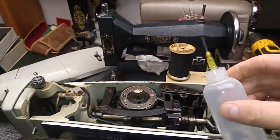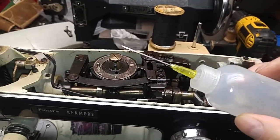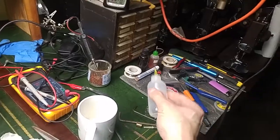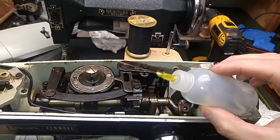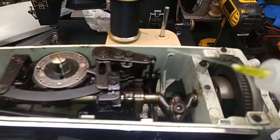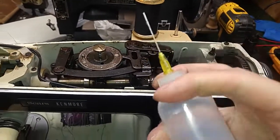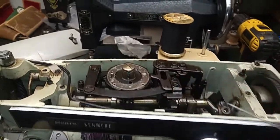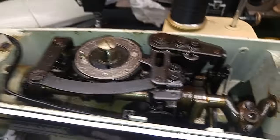These little handy needle spouts are a nice little tool — I use these for electronics. I still have 99% isopropyl alcohol in there, and I got some of this for de-oxit for contacts. I've got a little one for flux used for soldering. I've got an extra one — a bigger diameter, I think they use them for vaping or refilling also. It's a really handy little directed spout. You can use syringes for electronics — you can push faster and spray in to dilute that de-oxit with isopropyl alcohol instead of spending as much on the can spray.